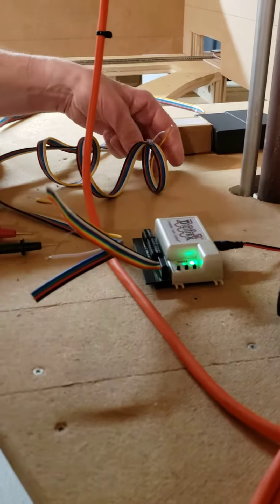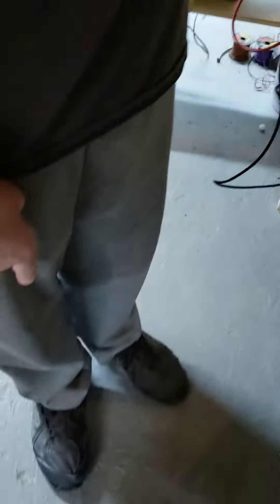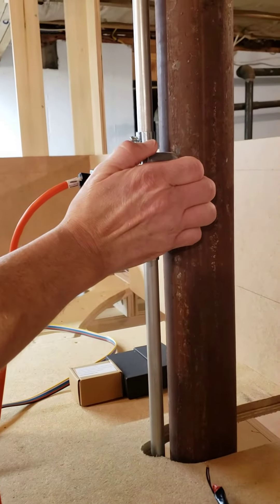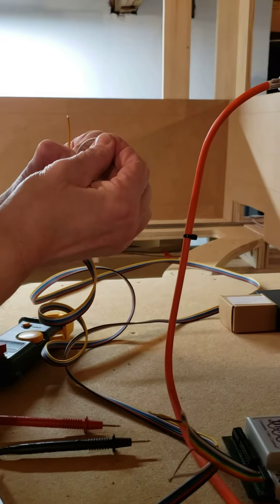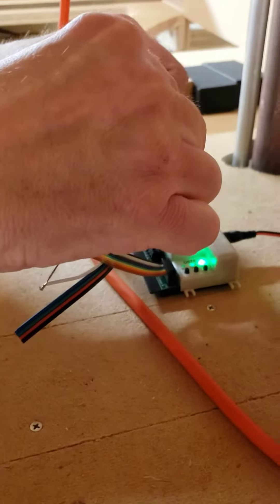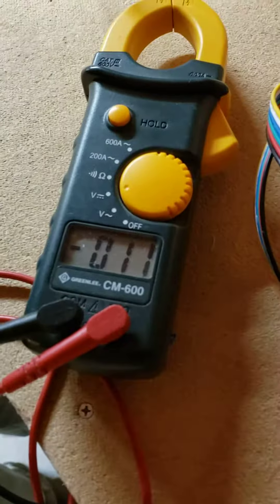First, I'm standing on concrete in sneakers. I'm going to touch a metal outlet box to make sure that I've grounded myself out for any static electricity. If I touch just the white wire, and now I go back — notice that the probes are in the same order — and we take our reading, I'm now reading negative 11 volts.